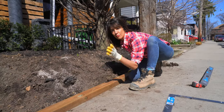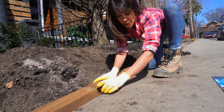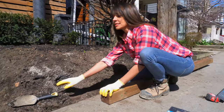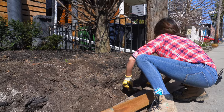I'm using 4x4 pressure treated edging, and I like to just dry fit it first. If you have grass here, you want this below the grass line or the sidewalk, because that's going to help stabilize the edging. I'm just going to dig down about four inches, and we're going to use gravel for drainage. I'm just going to get my limestone.